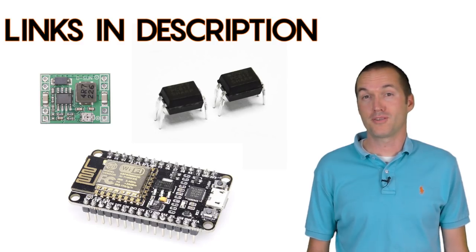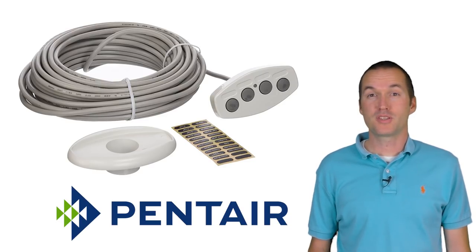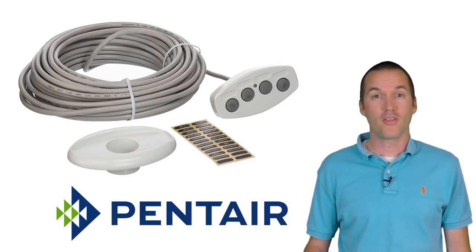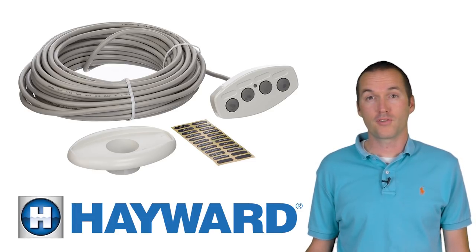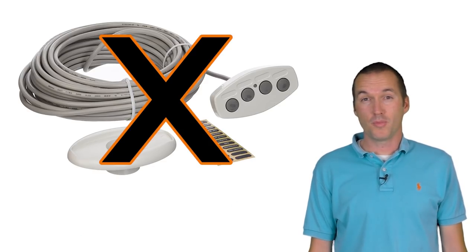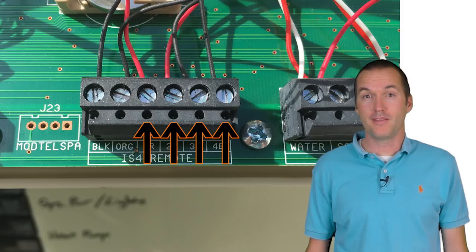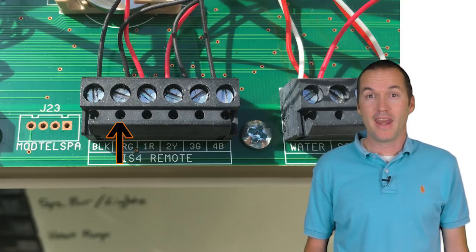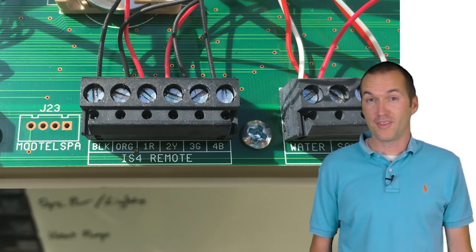Links are in the description for all the parts you'll need. On my pool controller, the Pentair EZtouch 4, there's an option to connect a set of four buttons called a spa side remote. That spa side remote is supposed to be mounted near your spa so you can turn on the lights and toggle modes between pool, spa, and cleaner. Don't be discouraged if you have a Jandy, Hayward, or some other brand — spa side remotes are available for almost every one of these and they all have very similar electrical connections inside. What I want is to emulate a spa side remote from my smart home devices. The connector for the spa side remote has four pins for the four buttons, one common ground, and an output for an LED. To emulate button presses I'm going to use something called an opto isolator.